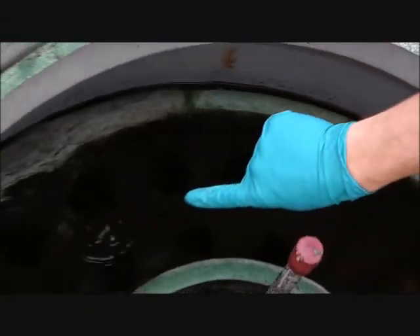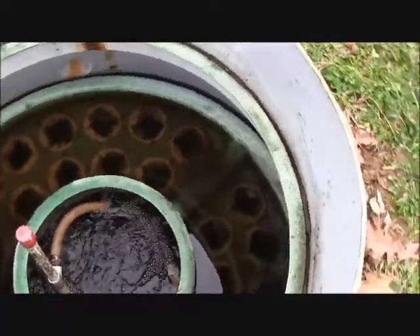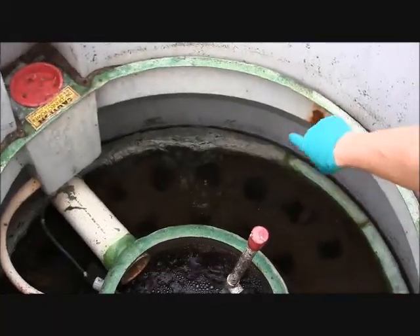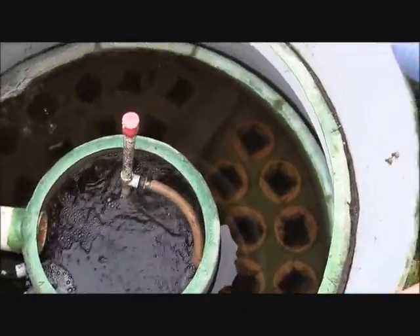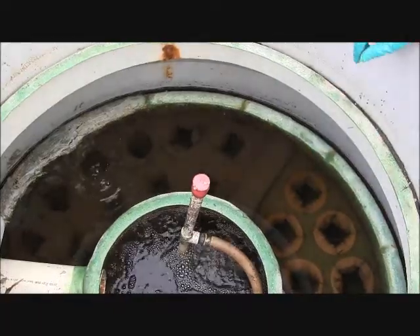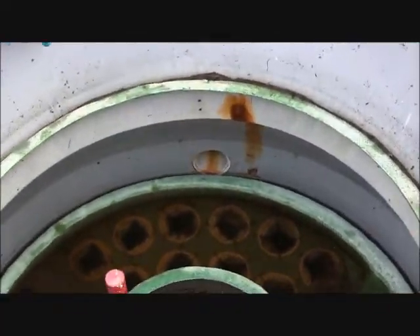We ensure that the weir lip, where water must pass over the very outer rim of the unit, is intact and that water is not dominantly going over one side. In this case, the weir has been brought up a little high, as water is no longer being discharged from one bank — only from portions of two other banks. This creates an issue as water flow is sped up, moving toward one simple release point. Ideally, multiple release points would allow for slower movement of the effluent off the weir deck and into the outer rim, then to the discharge point.